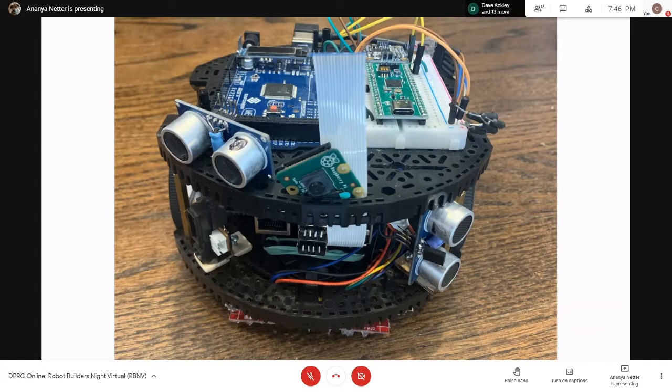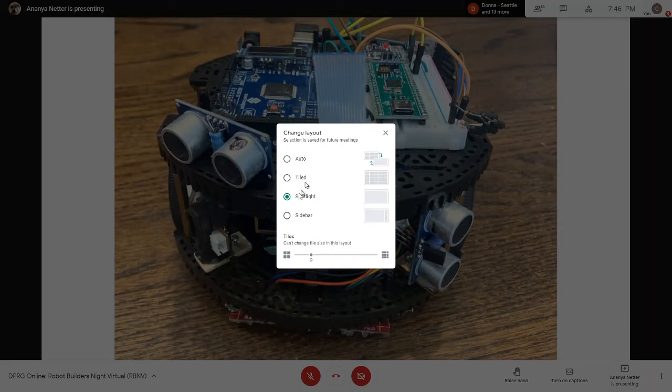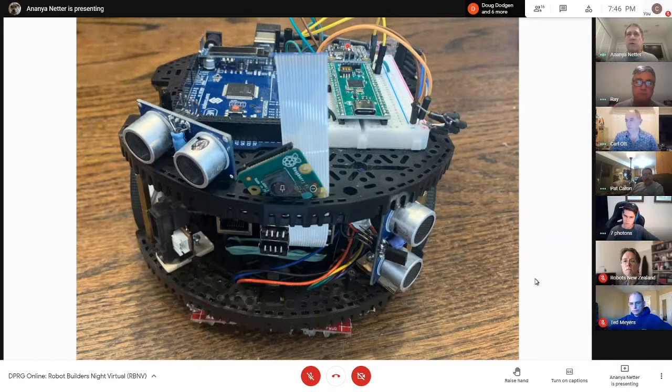Number one, it turned out that the SparkFun library that I was using for the BNO85 seemed a little bit inferior to the Adafruit library. I don't know why, but the SparkFun library occasionally doesn't succeed in initializing the BNO085, whereas the Adafruit library seems to do a slightly different initialization procedure. From what I've seen so far, that one just works spot on all the time. So, different library, better results, but still not 100% successful.